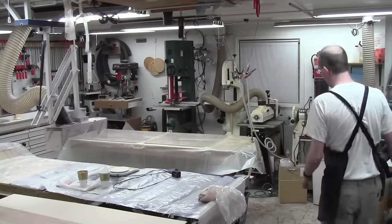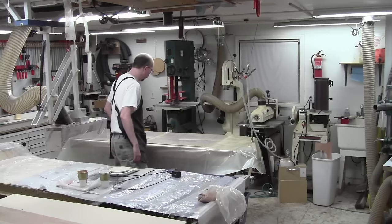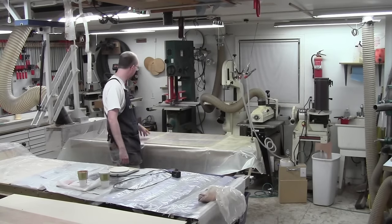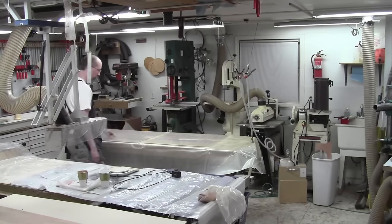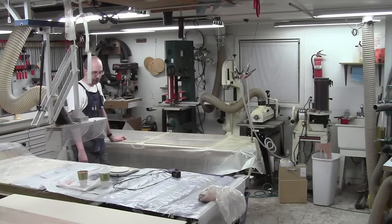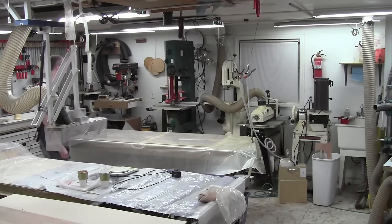Okay, well, it's in the bag. Turns out I did have enough glue. I used a little bit of breather mesh this time because it's so thin, the bag will seal itself off and I would get no vacuum over here, but lots of vacuum over here. So a little breather mesh to make a bridge across, gets the air a path to travel, and so on. It works.